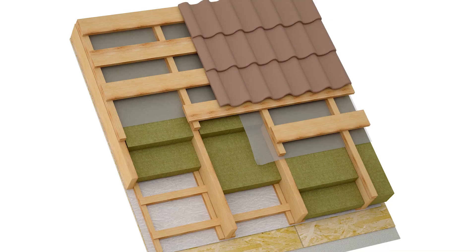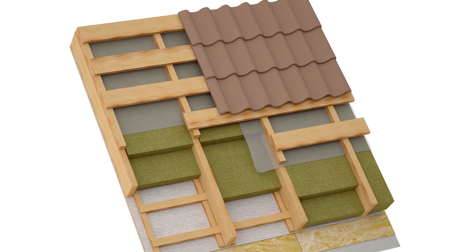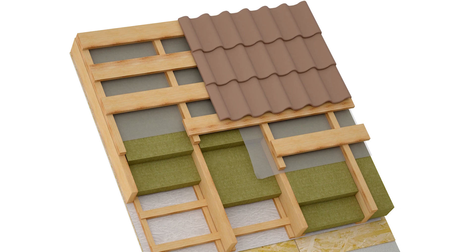The other approach is vented roof sheathing. When it's vented, you're going to have usually some type of rigid ISO with a batten and then a nailable substrate on top that you attach your metal roof to. You still use a vented ridge system, and then you'll have either a vented material behind the fascia of the roof system or behind the drip edge of the metal roof.